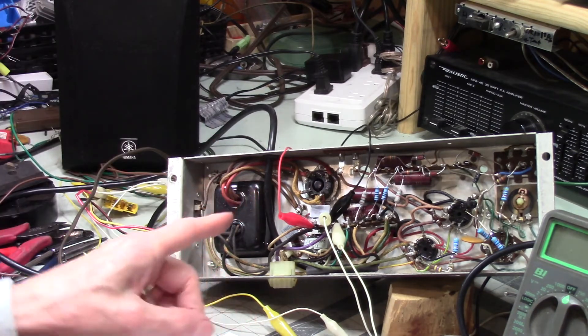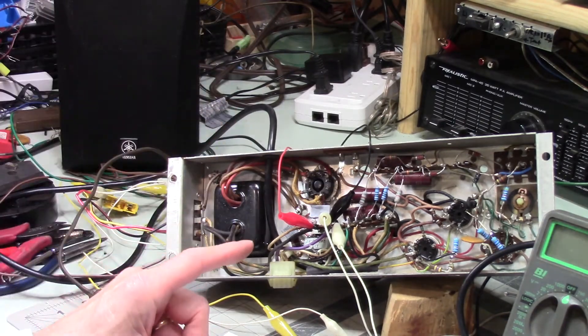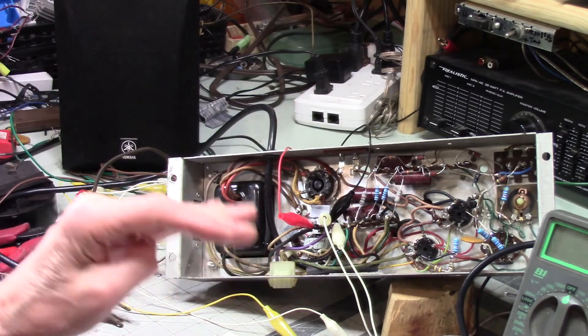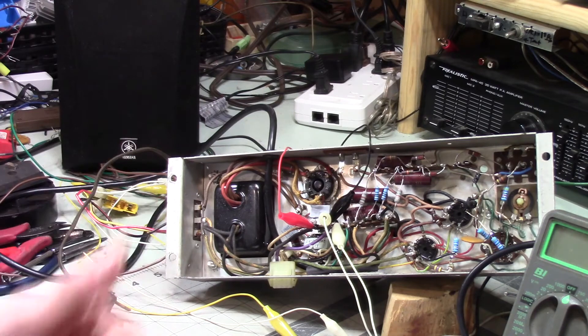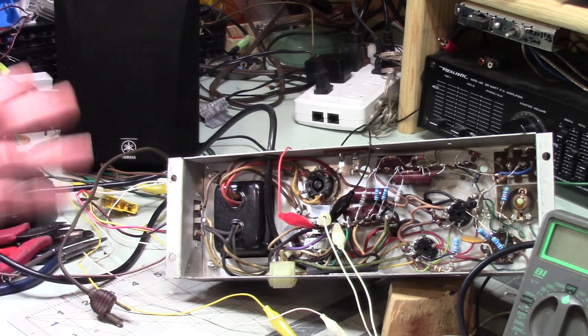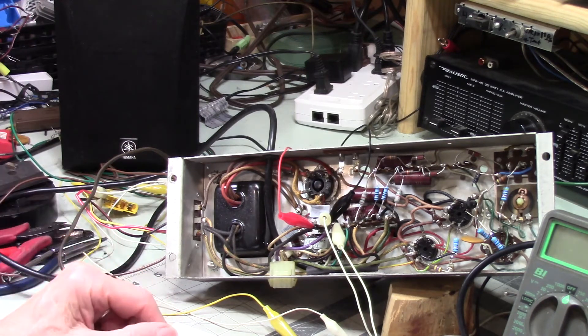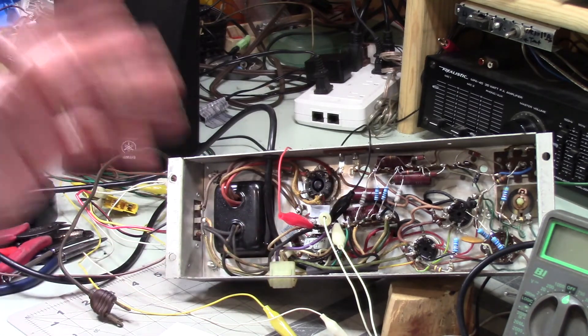What's going to happen is: once I put that polarized cord in here, I will test and make sure this thing is quiet. Then when I move it over to its normal position, we'll test again and see if it's still quiet. At that point I'll start banging my head against something. I'm hoping this is the last bulletin you'll get from me on this, because I'm hoping I've got it sorted. I was getting hum and also some almost-static sound.